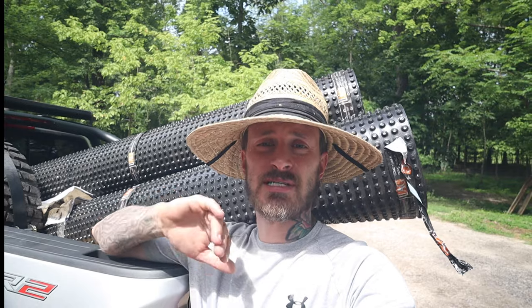Now that's a problem because we're only looking at about 5 feet going down, so that means that I would have to spend money on 8 rolls of someone else's product to only get that additional foot to get the dimple membrane up to grade. That would be an absolute huge waste of product and a huge waste of money. Some of those other products also have a filter fabric on them. That's great for keeping out sand and silt and stuff, but since we're backfilling with stone, sand and silt is really not a concern. So I didn't really think that I needed the filter fabric.